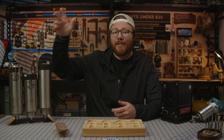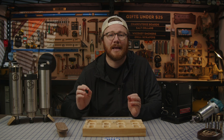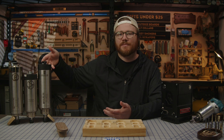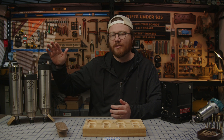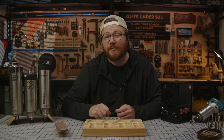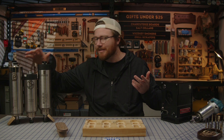The spindle uses four ceramic bearings that reduce rolling resistance, increase durability, stiffness, and minimize damage caused by cold starts. Right here you can see the difference between the CNC Labs spindle and the Redline spindle for Onefinity. Both have the exact same specifications, although the Redline spindle is significantly taller. At the end for comparison is the 220-volt spindle I've had on my Onefinity for the last year — these are relatively the same size, although the Redline spindle is slightly taller.